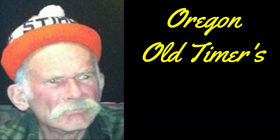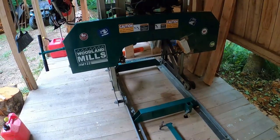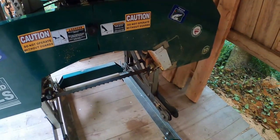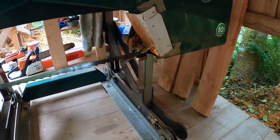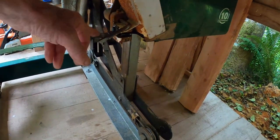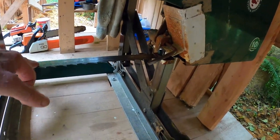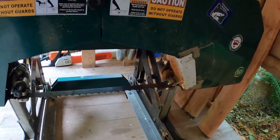This is just a quick update on modifications to my Woodland Mill sawmill and a Wood-Mizer addition. This sawdust deflection system has evolved. I didn't like the fact that sawdust that makes its way through here gets pinched between the blade and the drive belt — it comes out stuck here. It's a pain to clean when it comes time to sharpen your blades.